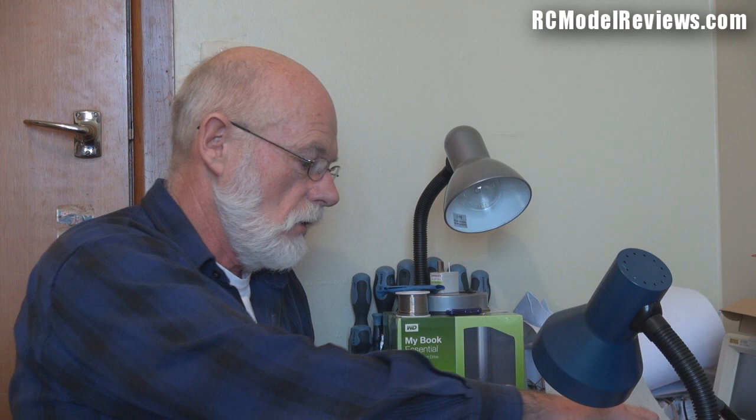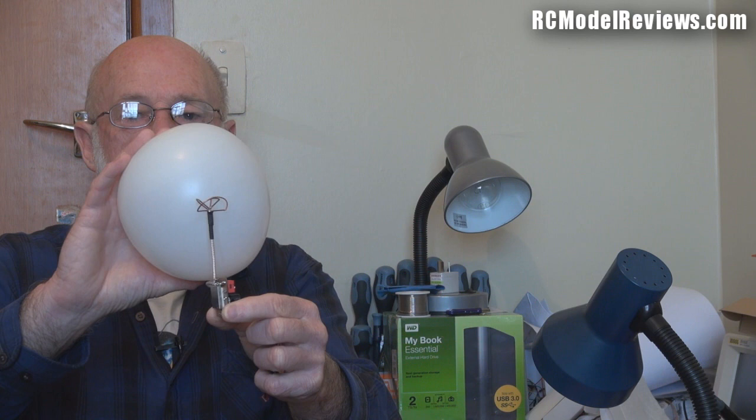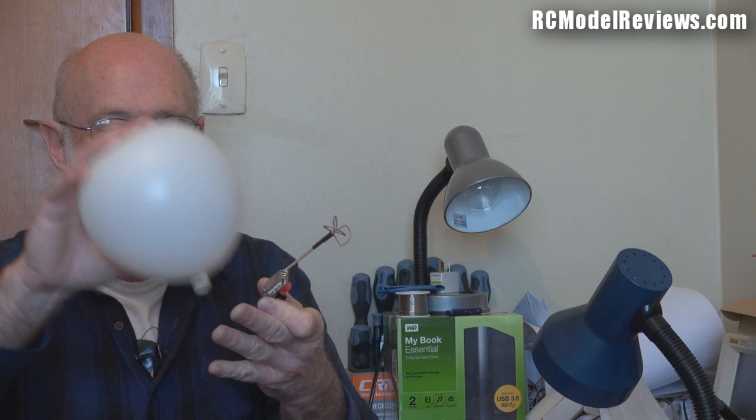Hello and welcome to RC Model Reviews. Today I'm going to talk about antennas — mainly FPV antennas, but this applies to all antennas whether for your radio control gear, your telephone, or your TV. Radio frequencies don't discriminate as to what they're being used for. If you have an FPV backpack like this, you've got a 200 milliwatt transmitter going into a circularly polarized antenna, which produces an omnidirectional radiation pattern — basically like a balloon. Imagine the antenna is in the middle of that balloon; the sphere of energy is the radiation that comes out, pretty much equal in all directions.